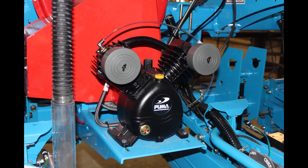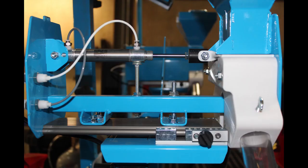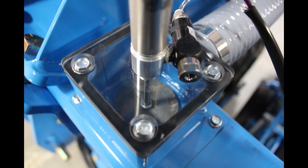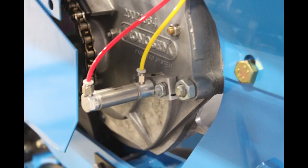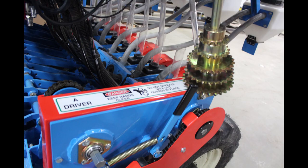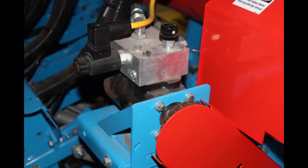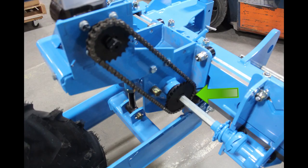The air in Classic Air is supplied by the onboard PTO or hydraulically driven air compressor. During the planter cycle, the PLC uses adjustable timers to operate pneumatic valves and cylinders to operate the dividers, staging gates, EVAC valves, and alley wipers. The Classic Air planter uses a mechanical, chain-driven transmission to set the seed spacing. It also uses a hydraulic motor and clutch to speed up the seed plate to plant plots with narrow alleys.